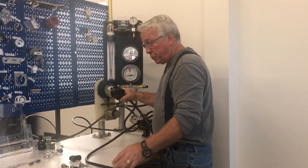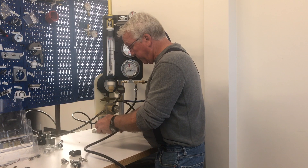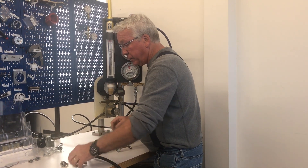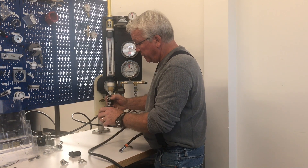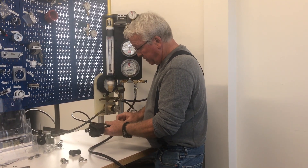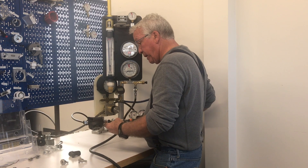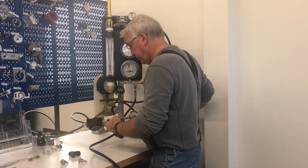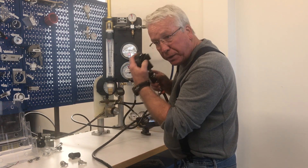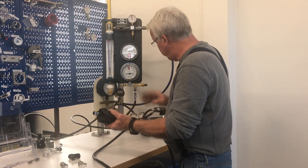If your cracking effort is too high or too low, we have an adjustment tool that will quickly make this adjustment. It's called the dual drive in-line adjusting tool. We will insert the tool in between the air line and the second stage. You can turn the air back on. We then engage the screwdriver blade of the dual drive tool and open the regulator — open the orifice until we hear it leak, then go back until it stops and turn it about one-eighth of a turn. It should now be properly adjusted.